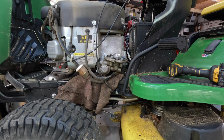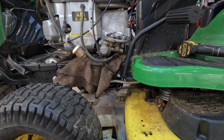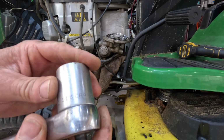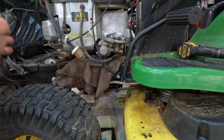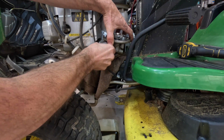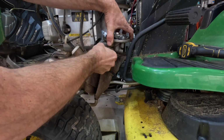We'll grab us a pan also. Little drain pan under there. Okay, let me hit pause. I gotta go find a socket. I believe that's a 24 or 28 millimeter. Let's find out. Hang loose. Okay. I don't have a 28 millimeter socket that big, but it's a 1 1/8, if all you got is standard. We'll have to be pretty quick with this. There comes the oil.